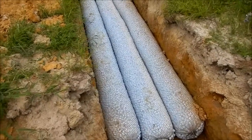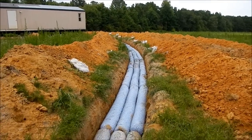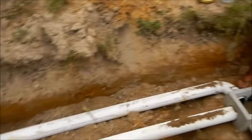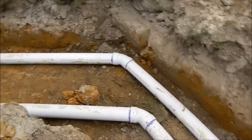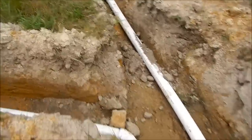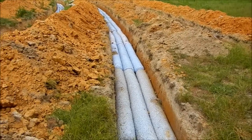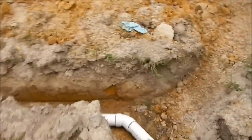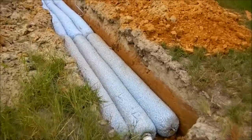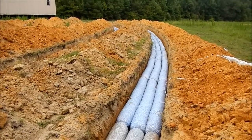These are the easy-flow lines and they run perfectly level with the contour of the hillside. The second line 45s off right here into its trench, and then the third one comes down here and 45s off into the third and final trench.